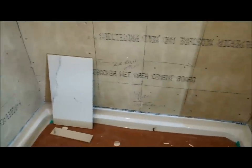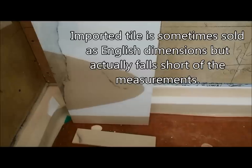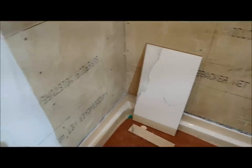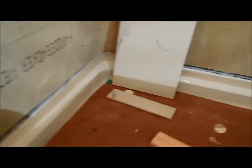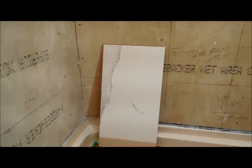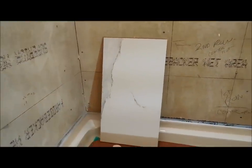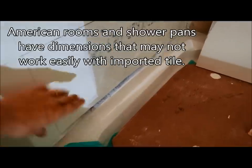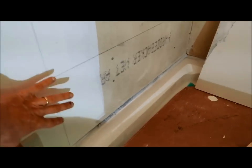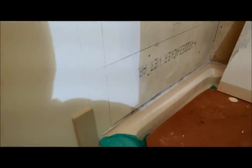This tile is an Italian tile, and often the tile stores will sell it as a 12 by 24 tile, but in reality it's 23 and change inches. That can have an effect when you're laying it out because as you come to the end, we'll be using a bullnose tile on the end. If it isn't actually 24 inches, as an American or English tile would be, the layout can suffer. In this case I'm going to end up with a little bit of a small piece here — no matter how I change the layout there's going to be an awkward piece. However, that will be covered mostly by the shower door, so I'm not too concerned about it.